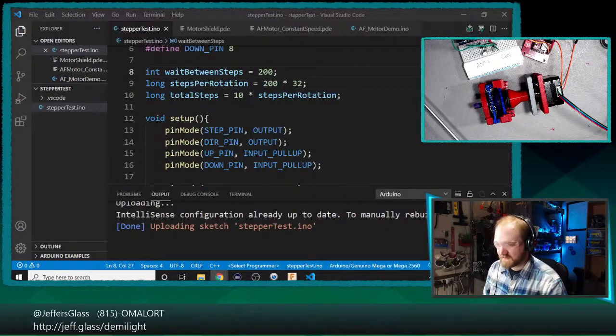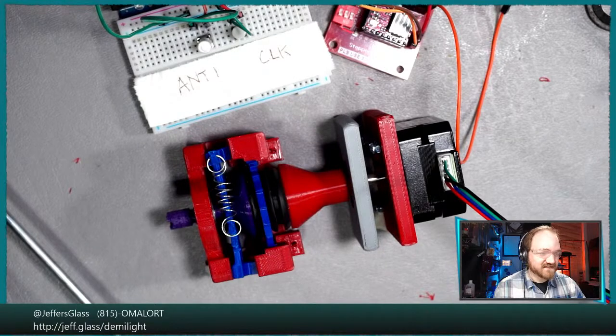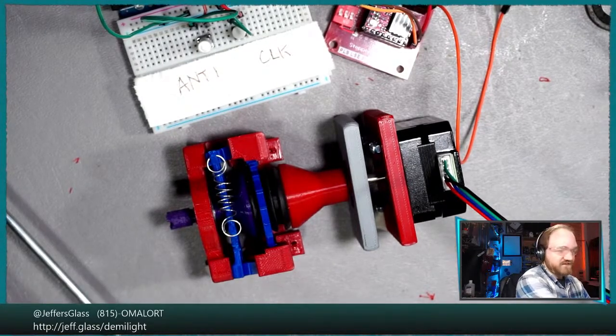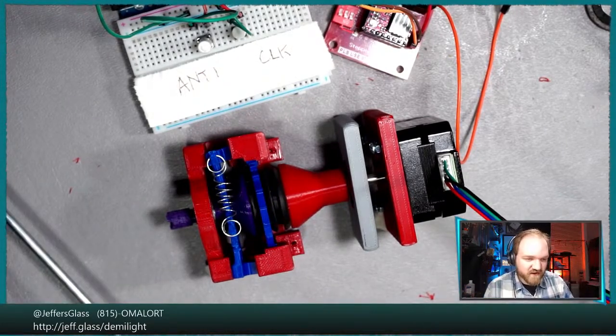You know what I'll do? I'll take this back off camera and we'll just go into the Amazon listing where I bought this, which I know explained. I've got these 3 little dip switches here that put it back into micro stepping or full stepping mode, and I can't ever remember what configuration of the switches is supposed to be which. So we'll just go back in my Amazon orders, although you don't get to see my past Amazon orders, and see what it says. DRV8825 breakout dip switches. Micro step size. Okay, so full step is all of them low, and with all of them high in the current configuration, we're at 1/32 of a step.